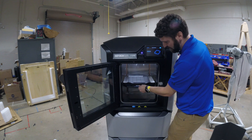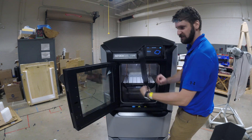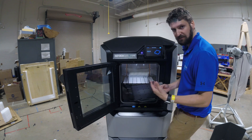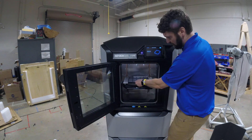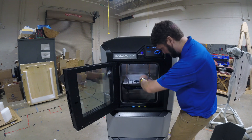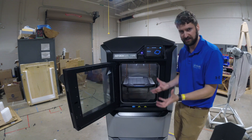I'm actually experiencing this right now — I can't clip it back in because this plastic, when it sits down on the hot metal, starts to curl. You can see it's curled up and away. One way to handle this, especially after you've just printed a part and are loading another tray, is to turn the build plate upside down for a few seconds. That causes it to curl the other way, and then you can flip it over and it'll drop into place and clip in more easily. That's a little trick to get those build plates in there if you're having trouble — it's usually because it's curled up.